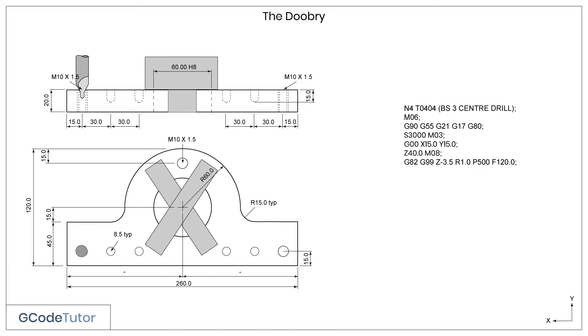As you can see, as we approach the clamps, 1mm is not enough to avoid the clamps. But on this line, the G99 tells the machine to only retract 1mm. For our first three holes, we don't need to retract all the way up.